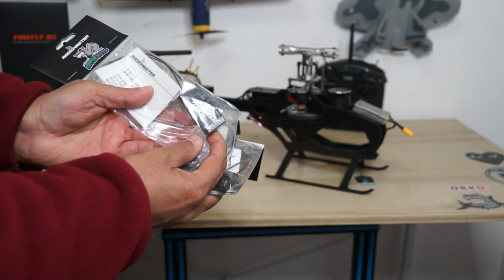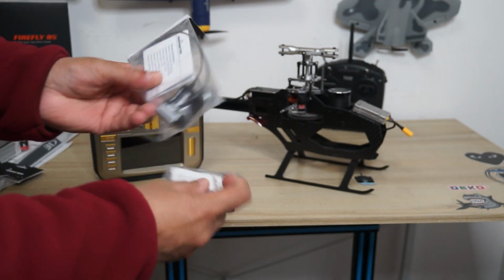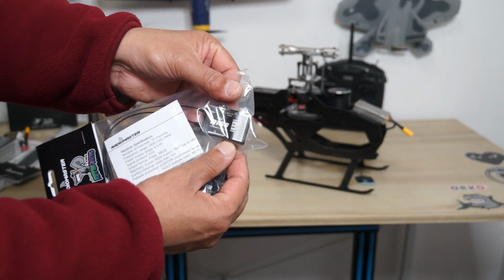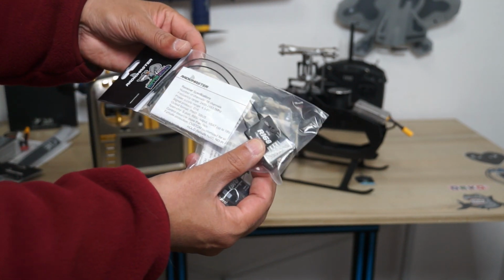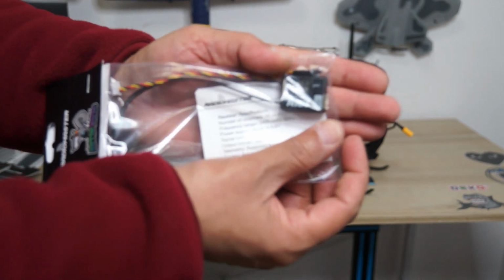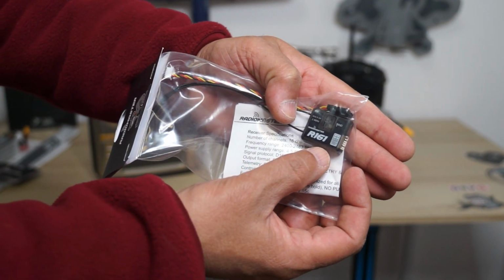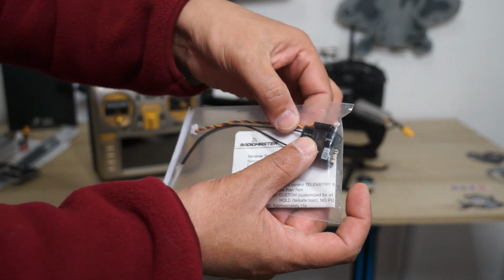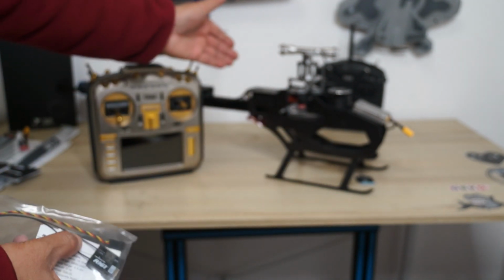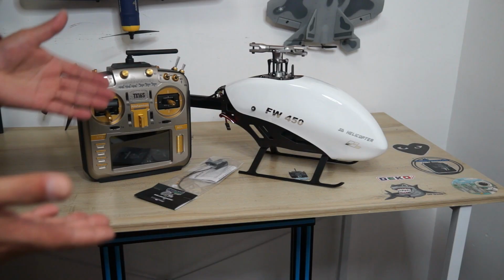I have R86C, kind of big. Nah, I will not go. R168 also says 8-channel PWM and S-Bus, kind of big. I'll not go with it. Yeah, this one, check this out, baby. R161 D16 S-Bus receiver, because I just need one cable to plug in the H1 Lite GPS autopilot. That's that. There you go.